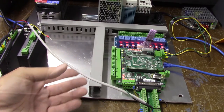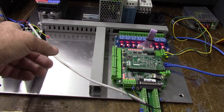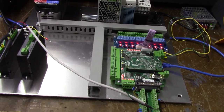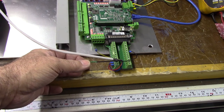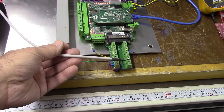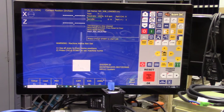This is a piece of shielded cable — I recommend using shielded cable when carrying step signals from the DB25 of the Acorn board to the drives. The shield here is not connected yet; you'll want to connect it to your chassis ground at one point where it comes into the cabinet. I believe it's 22-gauge cable, which is fine for these signals. Now that we've got one motor going, let's look at what this drive is set up for and configure it in CNC 12.